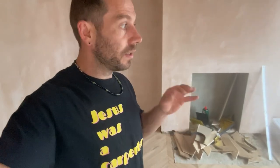Overall, as it goes together, it blends in and looks good, but you have to really take your time, put your glasses on, and focus on every single board. I don't use any hammer with these boards. When I glue them down, I use a few tools to tighten it up, even tap it with a foot, but with these ones you can't really do that much. You just glue edge to edge, tongue and groove, slide them in and tighten them with your hands. Just take your time and focus on every single board,